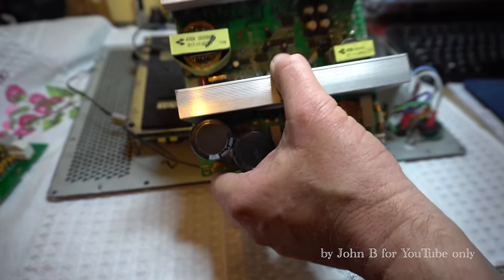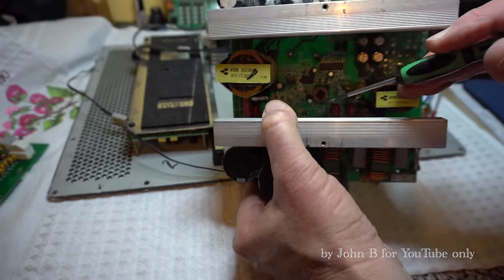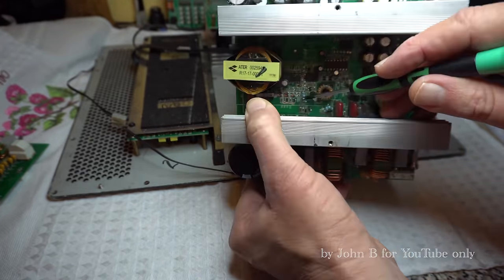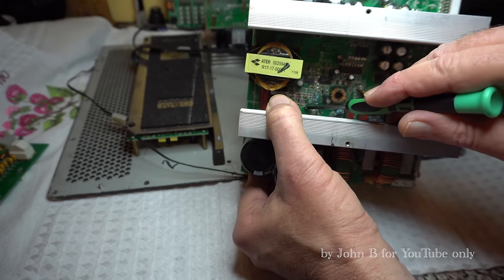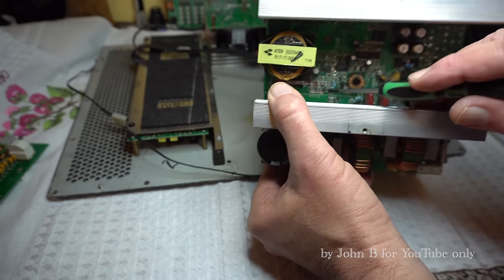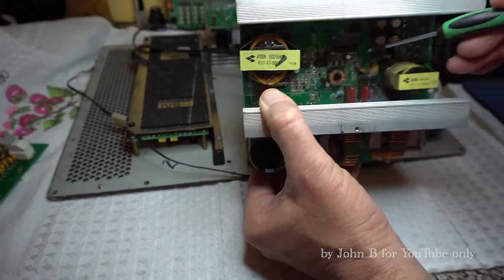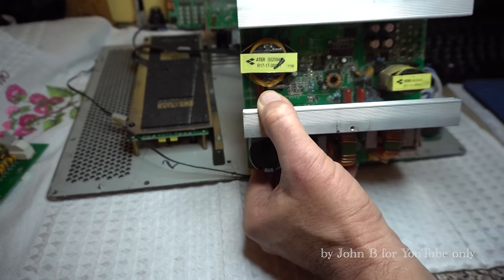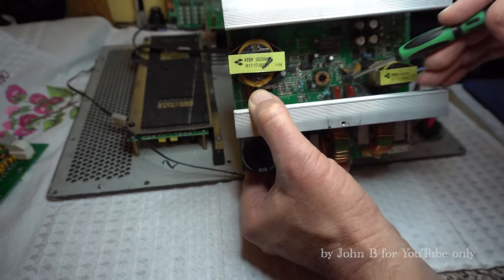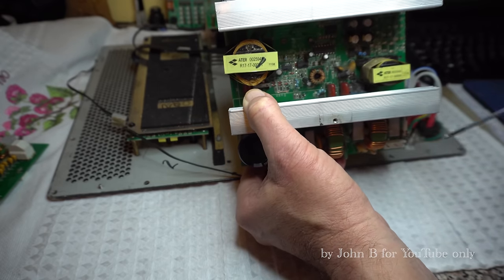we've got two transformers. I haven't seen a PFC booster in the circuit drawing, but in here, not sure if you can see, some of the surface mount resistors have obviously been blown and bypassed. There's a track that's got hot. There, resistors standing up, two joined in series in place of one surface mount, so it's sort of been bodged. But if it repaired the power supply, it doesn't matter, but I'd sooner see the genuine components. Because of these sort of bodged repairs, I don't know, did this power supply work, or did it work properly?